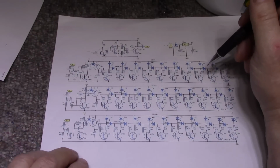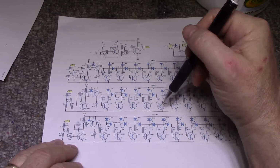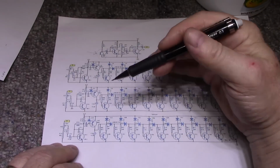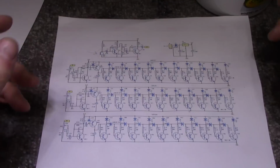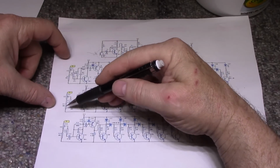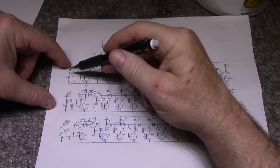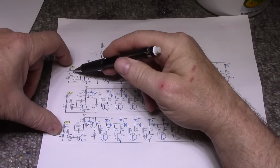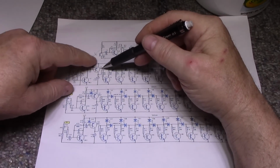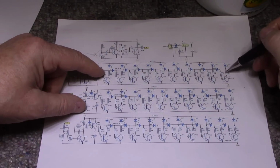What it looks like is going on here is we have a couple of transistors on the front end of each band. We've got high, medium, low. I don't know which one's which because I can't read any of the values on this schematic. When I blew it up to fit the sheet, it came out poor resolution. But we have a volume potentiometer for each band input, and our signal comes from our amplifier up here and feeds into these 3. So we have independent adjustment for each band, and then it looks like it goes through a 2 transistor amplifier for each band, and then it goes up to this display configuration.